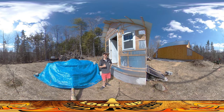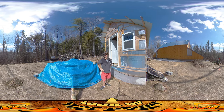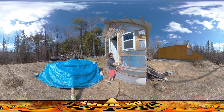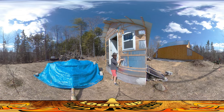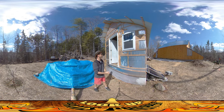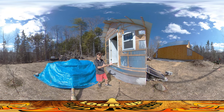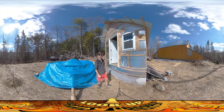Although now that I'm speaking out loud about it — what if I want to charge batteries in here? Maybe I'd want battery chargers on the shelf and something to plug in. I'll have to think about that. What I need to do before I can put on any of the wall boards is the electrical wiring. If you recall how we do the house, the boxes are on the inside and the wiring punctures out through the foam and runs along the outside underneath the exterior board. So I need to get the wiring up before I can do those exterior boards. I'm probably going to end up putting in that extra outlet — it'd be nice to have an outlet right there, maybe elevated up.